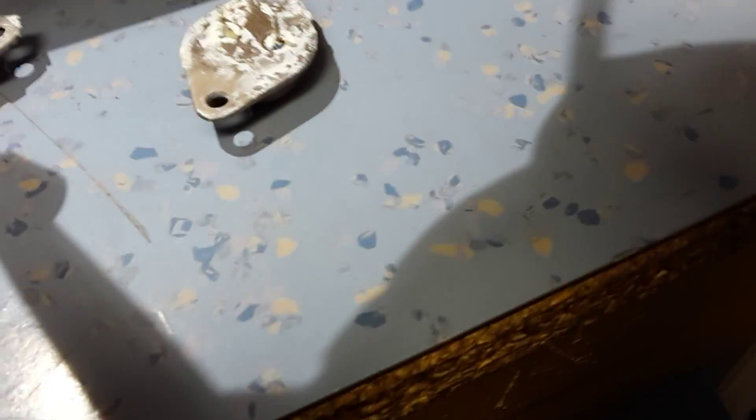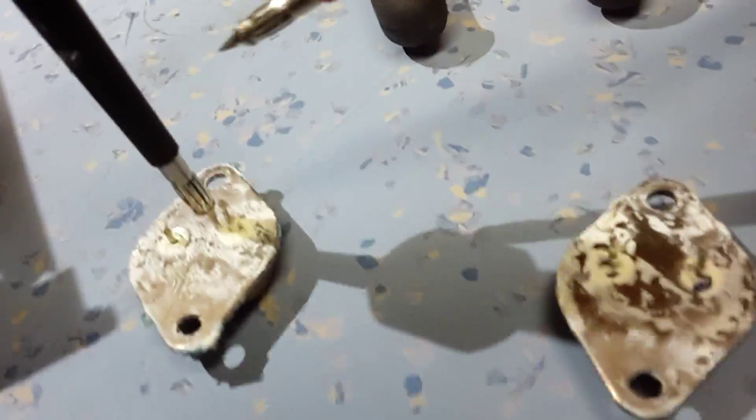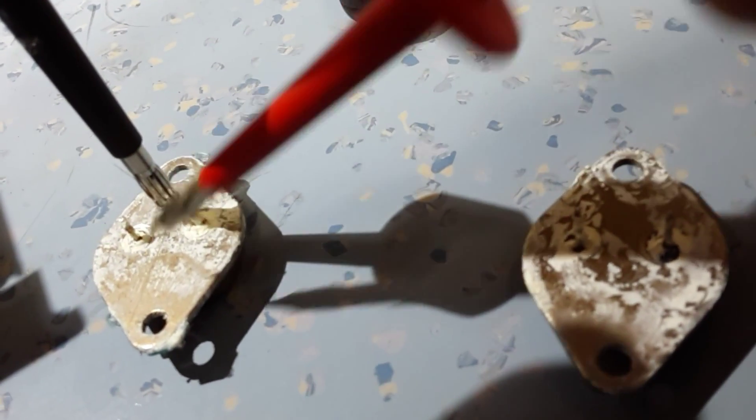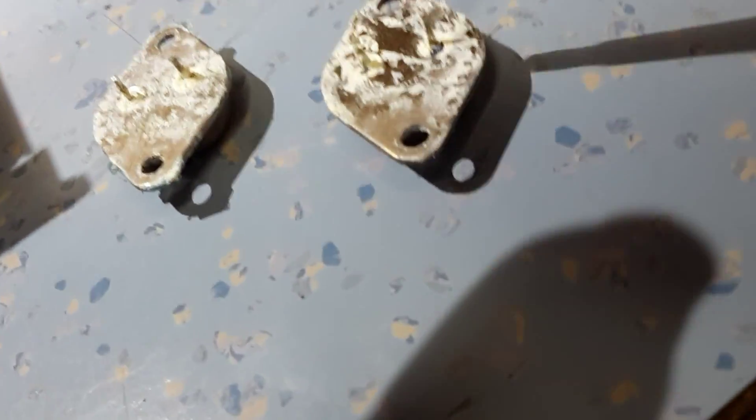It's a bit difficult one-handed, but let's have a go and look at the right transistor on the tester. There we go. Okay, that's the collector. So here we go across the emitter — short. Base is okay. So collector-emitter short, that transistor's gone.